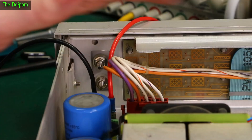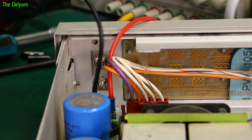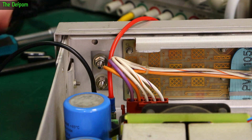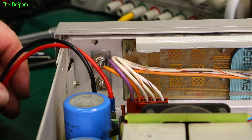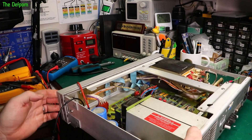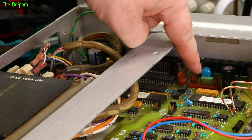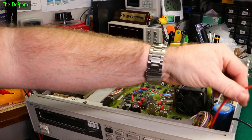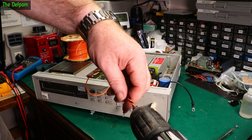Binding post attached. So I've refitted the front panel and I've got some cables prepared. This is actually silicone wire — a bit of overkill, but that's what I had laying around. You have to actually put the front panel back on again before you can attach these; you can't get through the hole in the front panel. Now the next thing I'm going to do before I attach these: I need to find the connections for the sensor terminals which are around the other side over here. I believe it's like pin 13 and pin 8 or something like that, but I need to run wires from here down around the front to where those terminals are and attach them all at the same time, so the sensor terminals are directly piggybacked onto these. I need to twist some wires together to run to the sensor terminals on the back.